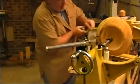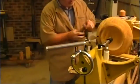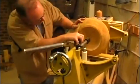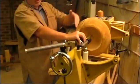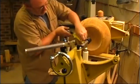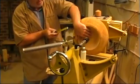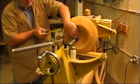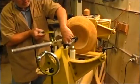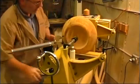The depth of this one. The radius of this cutter here is about 6 inches, I'll say 6 1/4 to the outside. Currently I'm at a depth effectively of about 3 inches, which is what I thought from the last time. So if I've got 6 1/4, I'm 3 inches deep already, and I want this about maybe an inch thick. Not quite. I'll need to have about 2 inches between my center line and the front of this piece. Again, this is all just guesstimating.